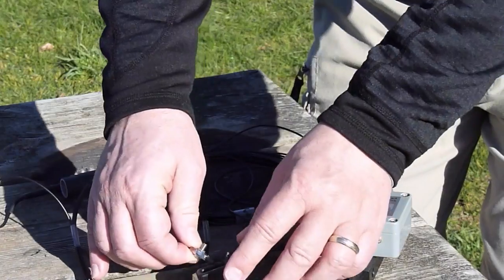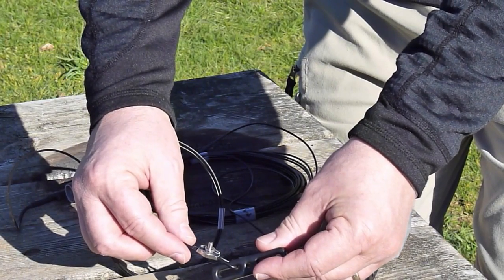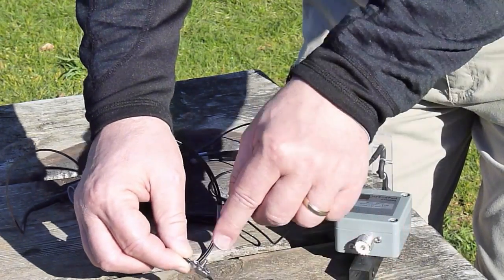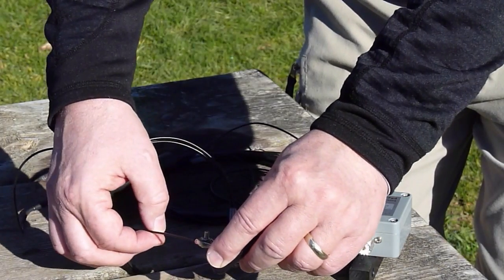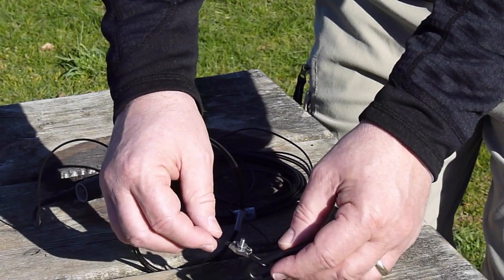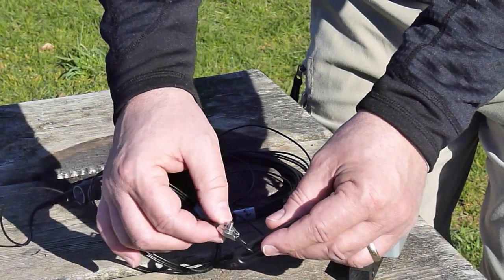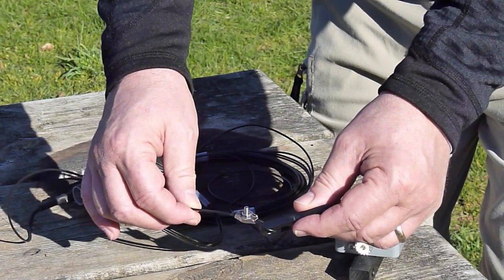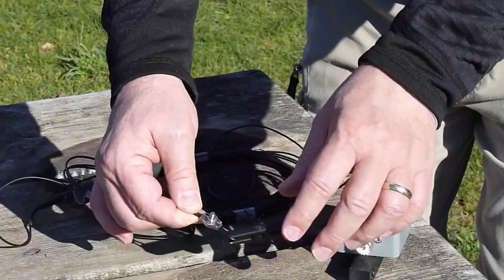Let's take a look at the tail end — this is the far end of the antenna, and they've got a clever little device designed to allow you to shorten or lengthen the antenna without actually cutting the wire. There's a screw here; the wire comes in and around. You loosen up on the screw and pull the excess wire through to make the antenna shorter if needed, or you can lengthen it. You can see it's in its fully extended position right here. When we get the antenna up, it'll likely be a little bit long and we'll be able to adjust it very easily without cutting — important because every installation location has its own requirements.